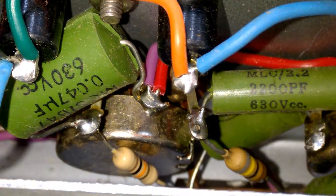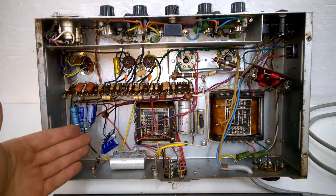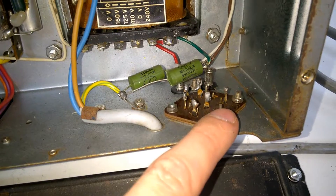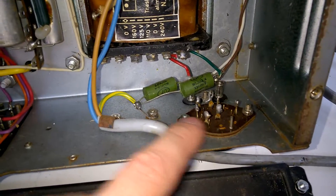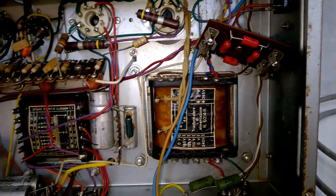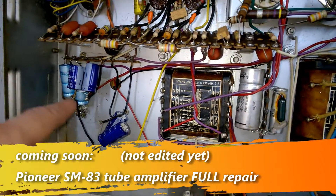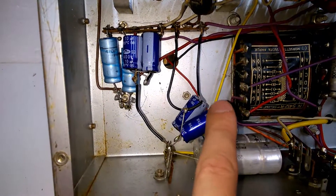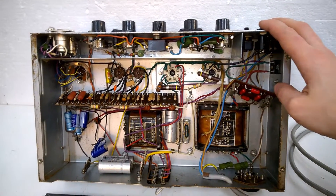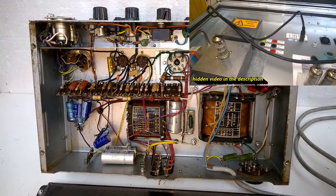Interesting caps — they probably need replacement, who knows. So if you have such a unit, what should you do? This is still okay; you don't necessarily need the AC mains input voltage selector — you can wire directly to the transformer with or without this switch. You would certainly replace all of these caps. Other than that, there's not much to do. Replace the tubes if they are faulty or don't have enough current anymore.